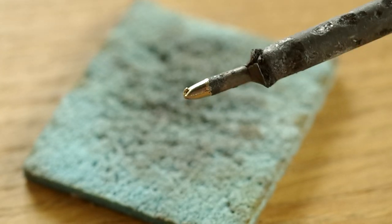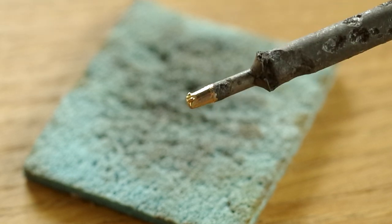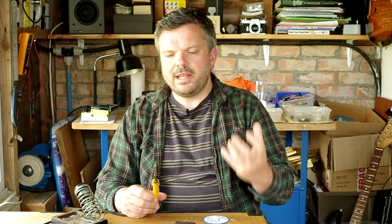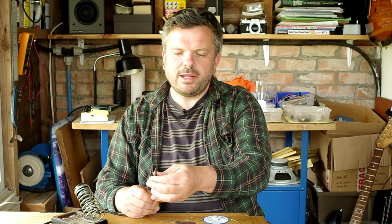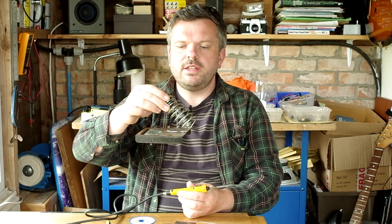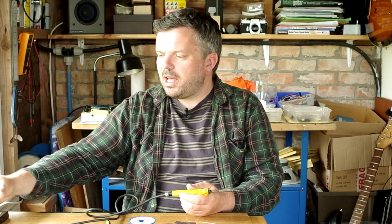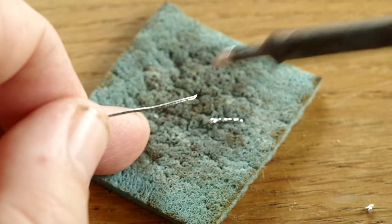If you have a look at the tip of the soldering iron, it's quite wide, which gives it good heat distribution. I would stay away from the type with a very thin pencil end — they're great for doing pedals later on if you really get into this, but for most guitar jobs something with a slightly wider tip is perfect for getting started. You're also going to need a good stand, because the last thing you want is your soldering iron not being stationary when it's not in use. Most stands come with a sponge which you just get ever so slightly damp.